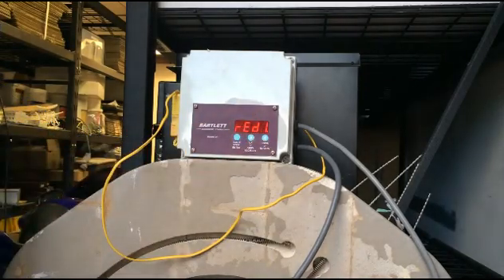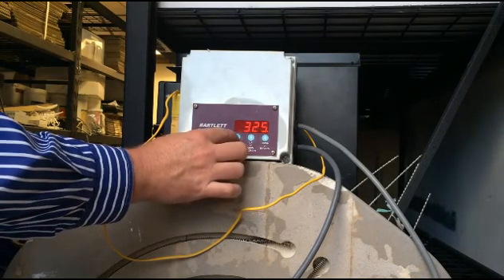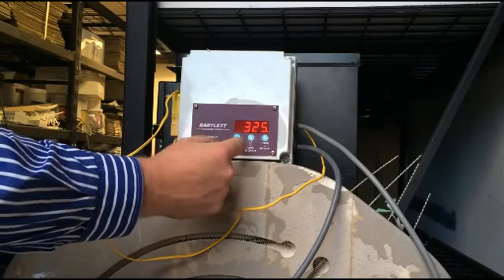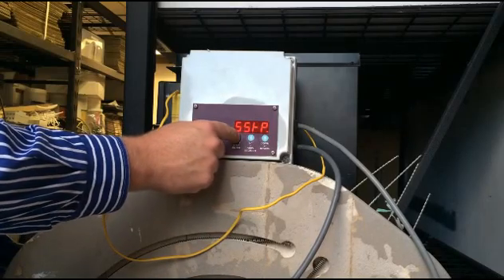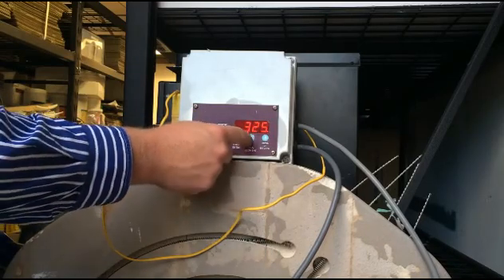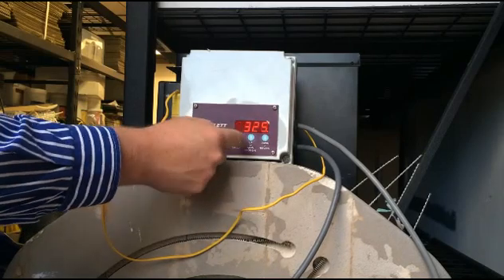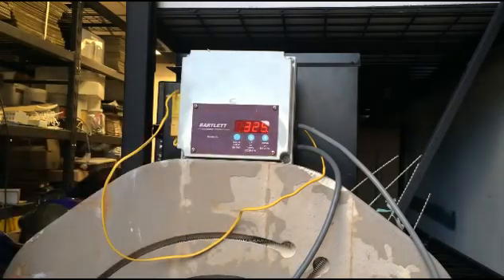It will now display 'Ramp 1'. Once you're at this stage, if you push enter again, the firing schedule will start. If you don't have any luck, hold on for a moment and it'll make a loud tuning noise as the kiln turns on. If you want to stop this, press stop. If you'd like to skip a segment, press the up arrow — it'll show you what the segment is and then display 'skip'. Press enter and it'll skip to the next segment. You can press up again and it says Ramp 2, skip that one, press up again and we're up to Ramp 3, and so on. If you do press enter, it'll flash 'stop' and 'idle' and that firing schedule is done.